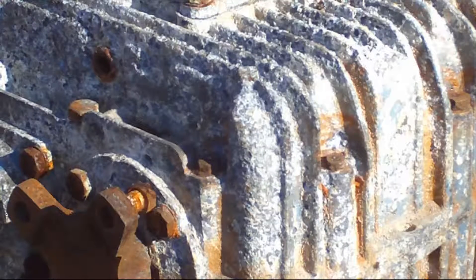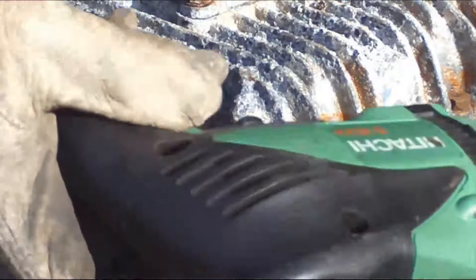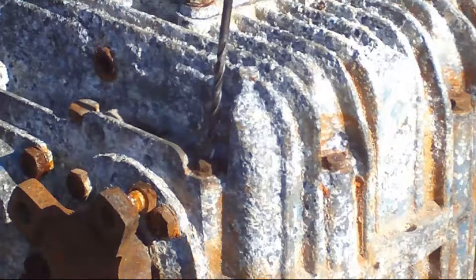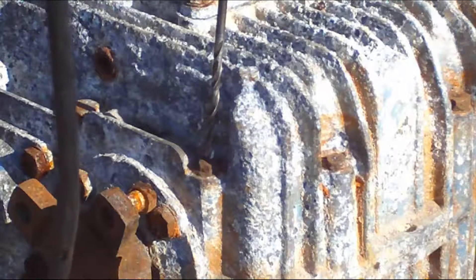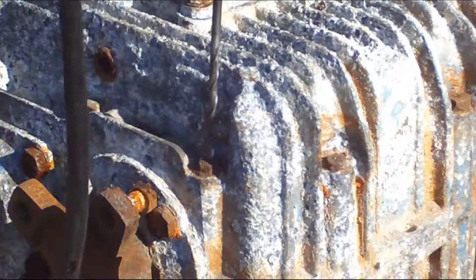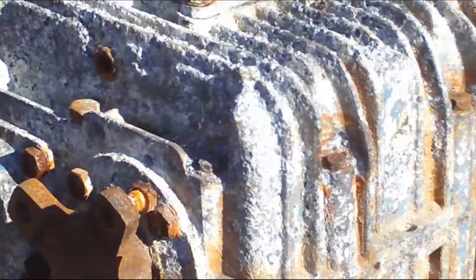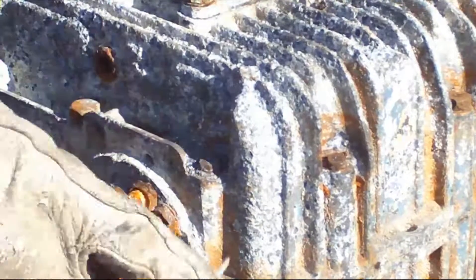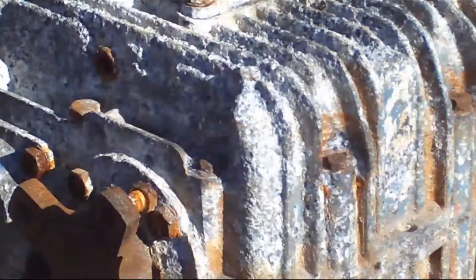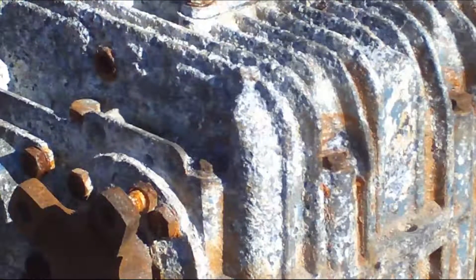Now, typically what I do when I'm drilling out metal by hand drill — my Hitachi D10BH, which really cranks out nice with AC power — is I drill a smaller hole first. Since I'm doing a hand drill I can't put a lot of pressure on the bit, so by doing a smaller drill you can get the pilot hole in. Then I move to a bigger bit.